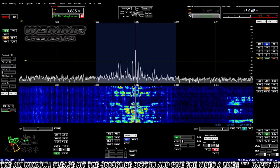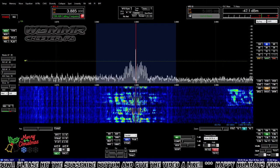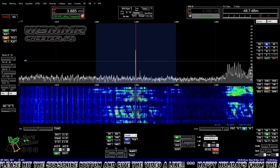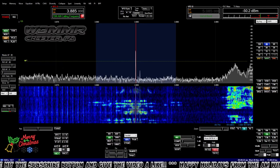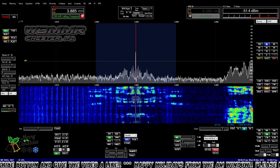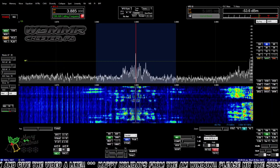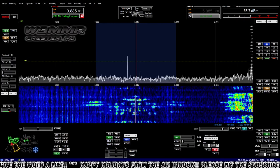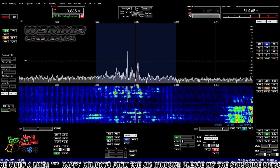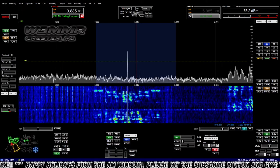At 90 degrees — let me move the slice up — that's 90 degrees, basically straight up, you're looking at 5.86 dBi. It's like going to a dipole, straight up. I'm pretty sure you're feeding that with coax, and I'm pretty sure it's resonant down in the DX portion of the band, so where does it all start falling apart?